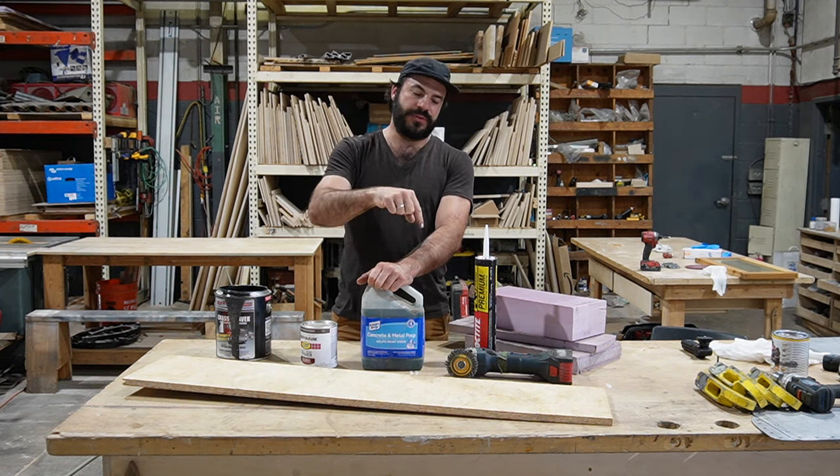I'm trying to keep this floor as flat as possible, which is hard to do because the floor isn't flat to start with. So my first sheet of foam is gonna be a full 4 feet wide. My next sheet of foam, I think I'm gonna go ahead and just rip in half so that I have a nice half stagger there. And then my first sheet of plywood, I think I'm gonna go ahead and have be maybe just shy of a full 4 feet. So maybe, you know, 3 feet, 9 or 8 inches, something like that. But what I'm gonna do is I'm gonna measure the full distance to make sure that whatever I do down here doesn't leave me with a really odd or tiny sliver up front.